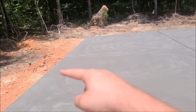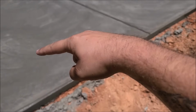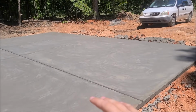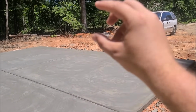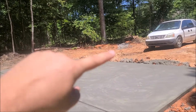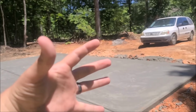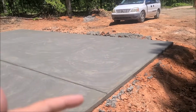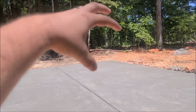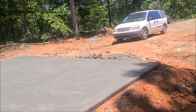And I don't know if I'm going to do a small server closet over in this area or in this area. That's where I'm going to put some shelving, put all my mining rigs in there, and then have openings in the side of the wall or in the side of the building. So I'll be intaking cool air in the bottom and exhausting hot air out of the top, and it's going to be sealed in that server closet. So that'll be framed in and just pumping air essentially. And then in the wintertime, I could always reroute it so it's dumping heat into the actual garage, but we will not need that in the summertime.